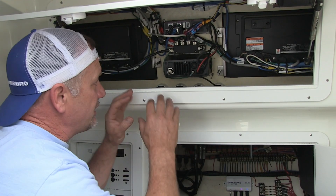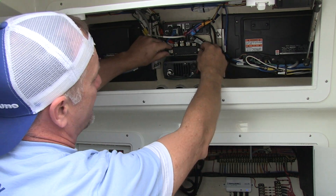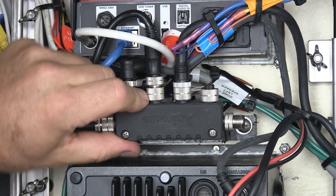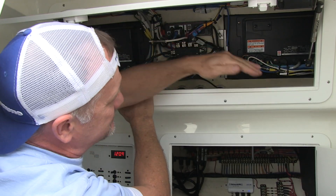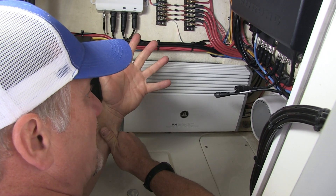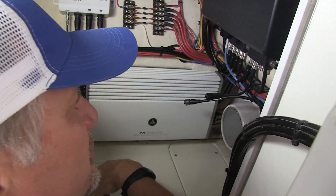The upper console area is finished with all the wiring and cables cleaned up. With NMEA 2000 there's about 50% less cables up here. Everything goes right into the ActiSense Multi-T. A small piece of starboard scrap was used to make a little bulkhead bracket, mounted right behind the radios. There was a string of Ts here that were wobbling and just tie-wrapped in — this is solid, nice and tight, not going to be an issue. The NMEA 2000 network is broken up into a couple of different ActiSense Multi-Ts: one near the MFDs, two in the lower console, and one by the autopilot.